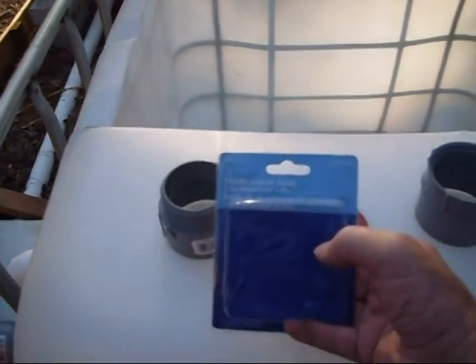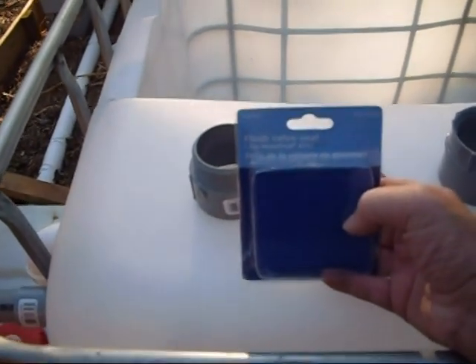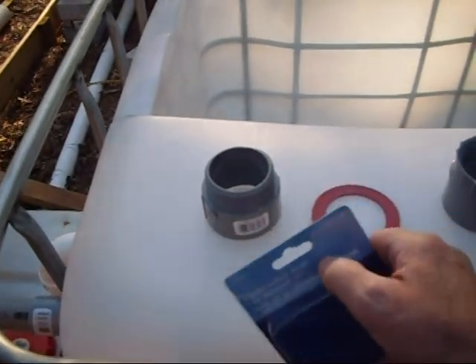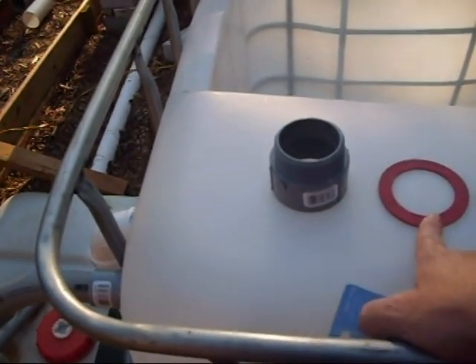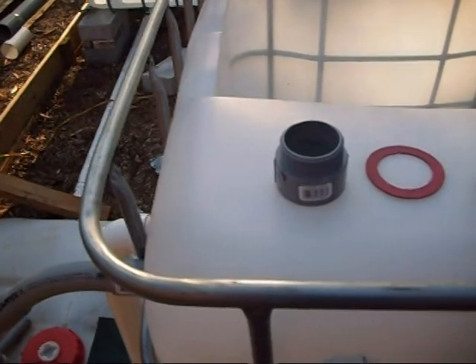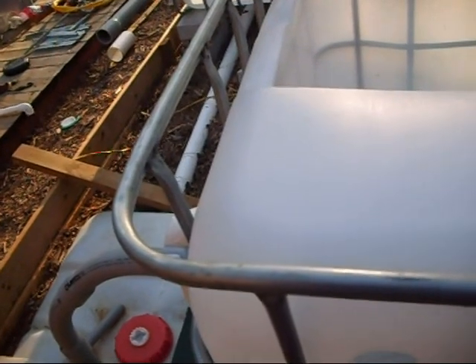It's just your standard flush valve seal. That's all you need. And if you need three inch, they make three inch flush valve seals or other three inch seals for use in toilets, shower drains, and sink drains — you can find a three inch flat washer, and they do make three inch PVC connections. All you do is put the washer over the male fitting. I pull mine all the way down so that it actually turns back towards the tip of the threads. That way, when I put it in and tighten it down, it flattens out instead of kinking against any of the threads.